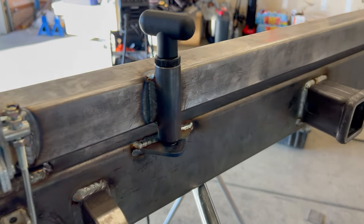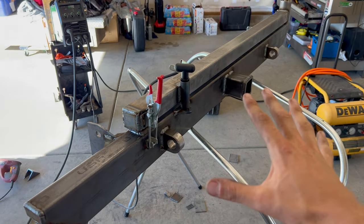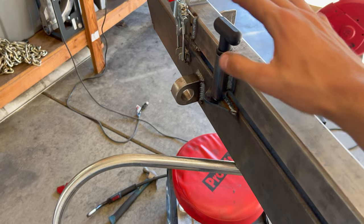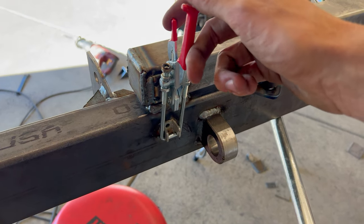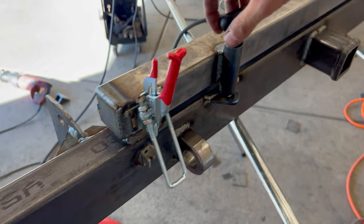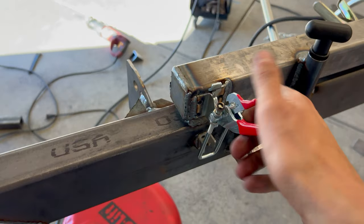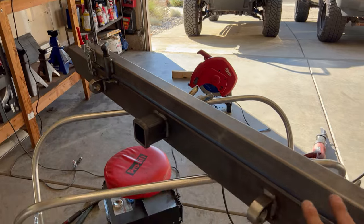Here are the locking mechanisms — these are what keep the tire carrier from swinging open going down the road. This main one is your pull-catch release, and this other one is basically just to tighten down the assembly and keep it from jiggling around. The weight of opening it is going to pull this lever and pull up on that. It's the exact same as the Filthy Addictions Off-Road one on my Cherokee — works awesome, keeps it nice and tight. I'm going to link all this stuff in the description so you can quick-buy everything in this project except for the steel.